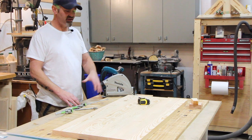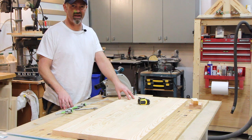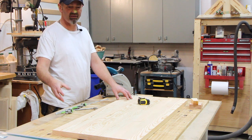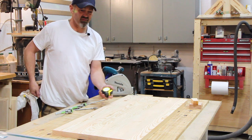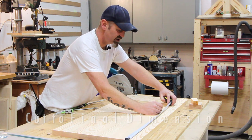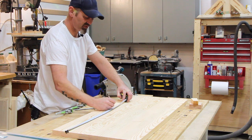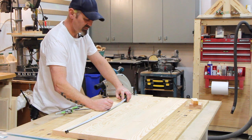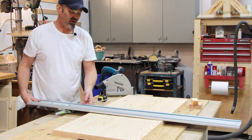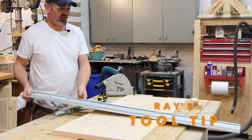In the last segment I processed and sanded the slab. This is a small slab but it's a good example of how you process any slab. I've already pre-squared one end, so I'm just taking my measurement — the final cut — and this one is only 23 and a half inches. I'm going to put a mark down for 23 and a half off both sides. The reason I do that is when you put the track saw down in the track, you want to line both sides up and get a straight cut. I wanted to talk about the Makita SP6000 track saw — it's a good alternative if you don't have a table saw.